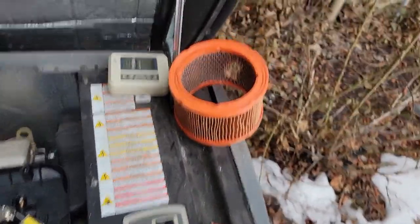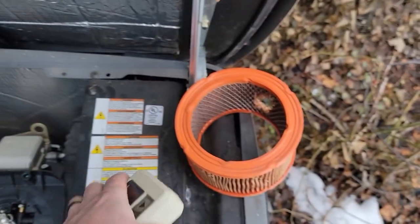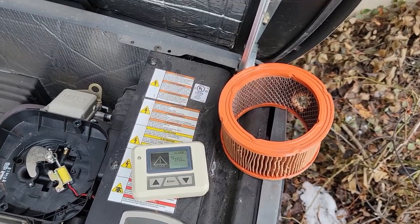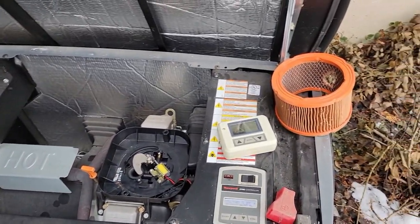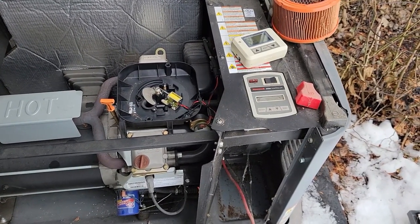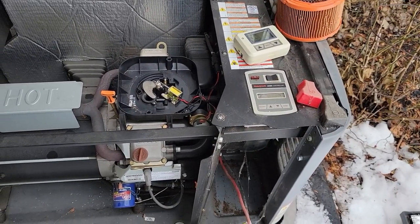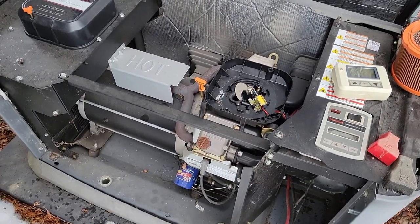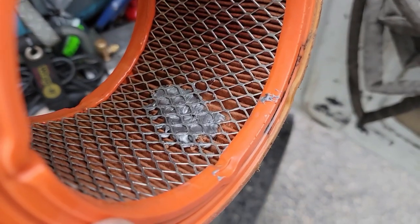This is one of the older controllers — pretty easy to navigate, didn't need any special codes, which is nice. Now this radio signal thing — there used to be a button to push to lock in. I tried changing channels, that didn't work. These remote verifiers have been really problematic. There used to be a push button on the back of the black transmitter; the newer ones have it built in but this one has a little box. It's been about seven years since I've done a bunch of these so you tend to forget. I went ahead and just siliconed the hole shut so dirt doesn't bypass the filter — good enough until summer when we can do proper maintenance.